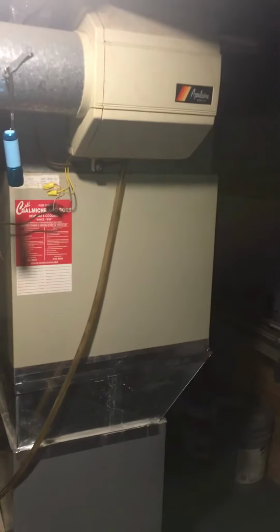This is a better view. But we want to remove the humidifier, put in the new sheet metal ductwork, and then cut the humidifier back in on the supply. We want to replace this hose line, the vinyl hose, to make that 3/4, tie it into PVC.